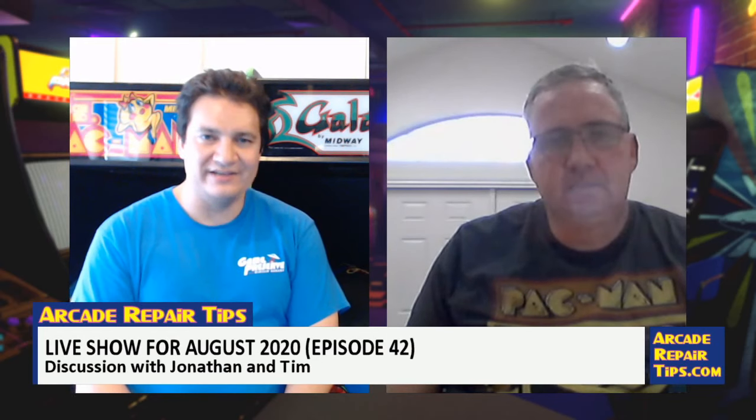Tim, this is something that we've talked about in the past. You can get solder board kits that actually will help you practice soldering. But Tim, a lot of times what we would do is you would just go to a garage sale or to Goodwill and get an old circuit board or something like that and just practice on that. A lot of electronics from the 80s, Tim, have really big solder pads, which are really good for practicing soldering on before you go on to a live board, right?